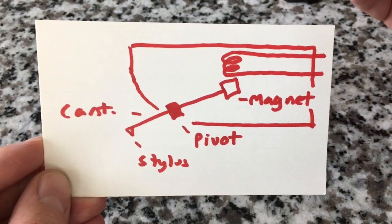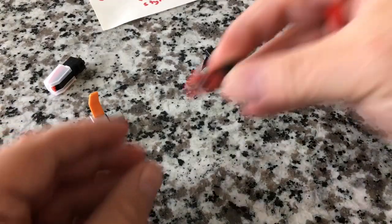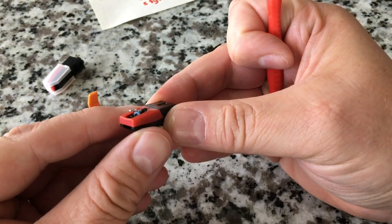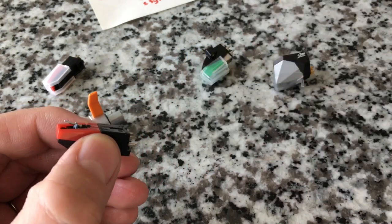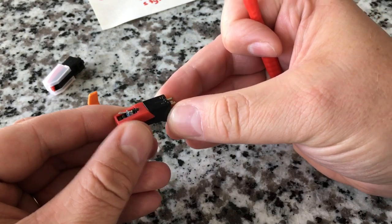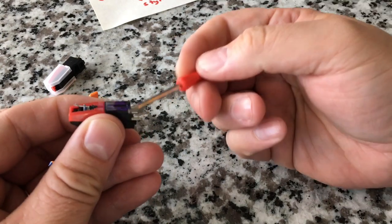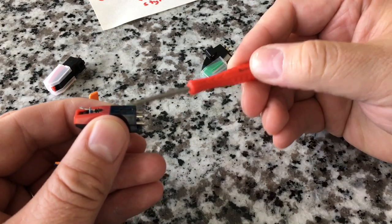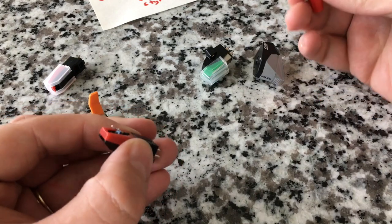The ceramic cartridge takes movement from the record grooves and bends the ceramic rod, which generates voltage that we hear as sound. Why do it both ways? A ceramic cartridge is cheaper to manufacture but outputs a higher voltage. If you output a higher voltage, you don't need a preamp. A preamp — sometimes included in the record player, sometimes external — allows the signal from the cartridge to match what your stereo system is expecting. A ceramic cartridge outputs a line-level signal, so manufacturers just connect it directly to the output without paying for preamp circuitry.